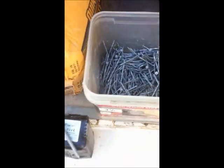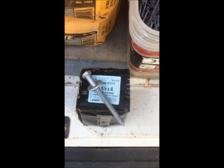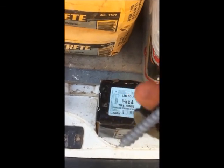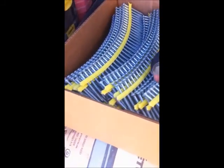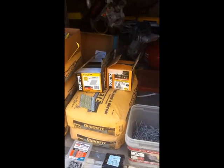For the posts and fastening the joists to the six by six posts, I'm going to be using three-eighths by four inch lag bolts with washers — nice and strong. For the decking, these are quick drive nail screws, exterior rated, two and a half inch. The quick drive makes it faster when installing.